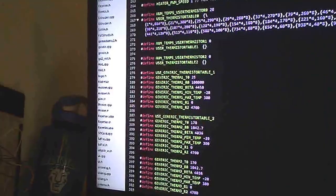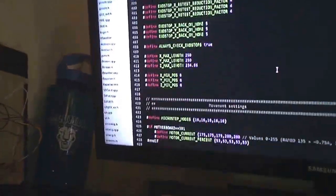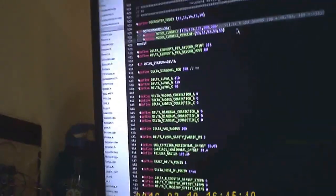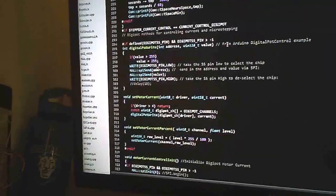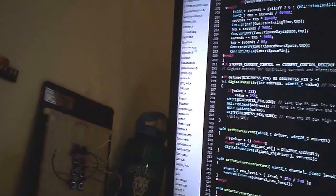I'm working on putting a PT-100 thermistor in here so I can get up to higher temperatures — above 300°C. The digital pot current settings are all here. The other extruder is broken out into an external stepper driver with a manual pot. When I was originally working, I ended up having to do some rewriting in commands.cpp, but when I went to 0.92 what I needed was already written for me. So it was basically just config.h and pins.h — your basic firmware configuration header files.